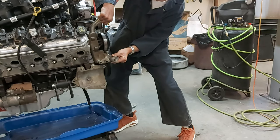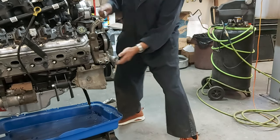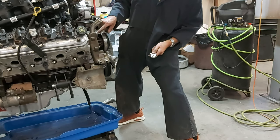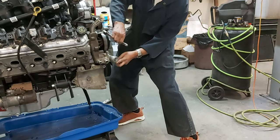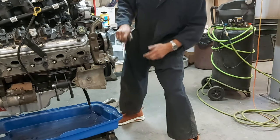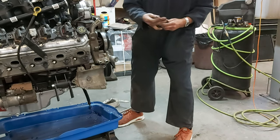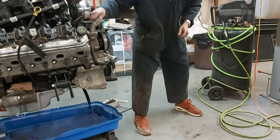Looks like I'm almost there — that's pretty much it. I'll pull this out. Pretty simple procedure. Aim for getting the hole in the middle because I'm running into the wall of the casting just a little bit on the corner — so don't do what I did, start the hole right in the middle. Looks like it might have worked — yeah, the threads look pretty good. Let's get the thread paste.